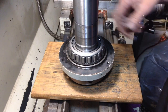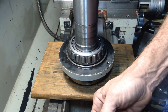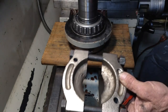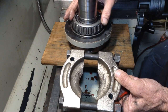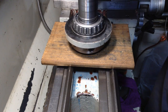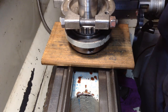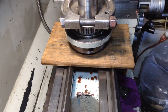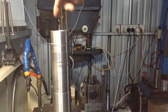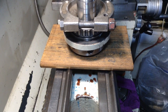So forget that idea. Another option, just if you can cut the cage off, then you can use a set of bearing separators clamped around the inner race, and of course you have two extension studs coming up the side here, so that would be clamped around the race of the bearing on the lip. You'd have two extension studs coming up to a crossbar. It'd be a crossbar on the top with your puller on the top, and you can pull it off that way. That's not really the wisest way